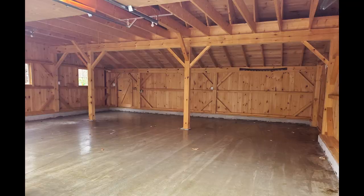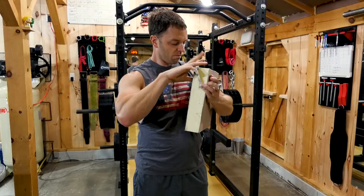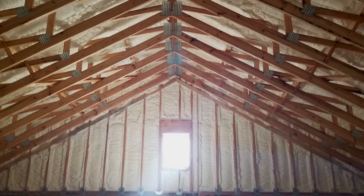For me, this area was completely bare — just the exterior sheathing. So I got reclaimed two-and-a-half inch poly-iso sheets, cut them to fit, and sealed them with 3M tape. The tape would just get stuck to my fingers and I would just swear constantly. I use the same process for the ceiling — we all know heat rises, so I just stack the layers to get a higher R value.